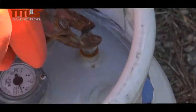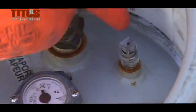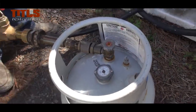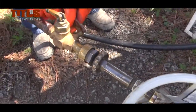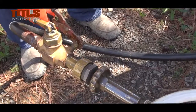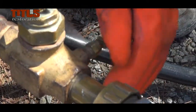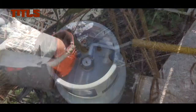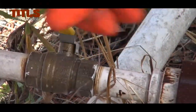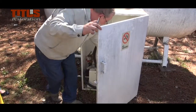Simultaneously, close the transfer pump valve and the bleeder valve. Close the main fill valve. Using the transfer pump bleeder valve, release the pressure from the transfer pump. Once depressurized, disconnect the hose coupling. Turn off the main pump. Close the pump door and lock with padlock.